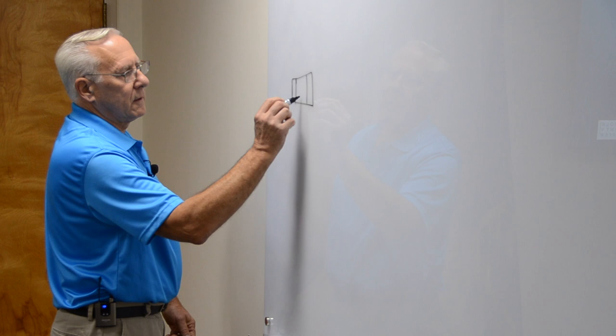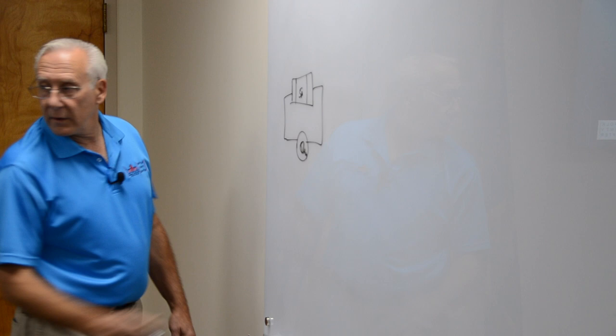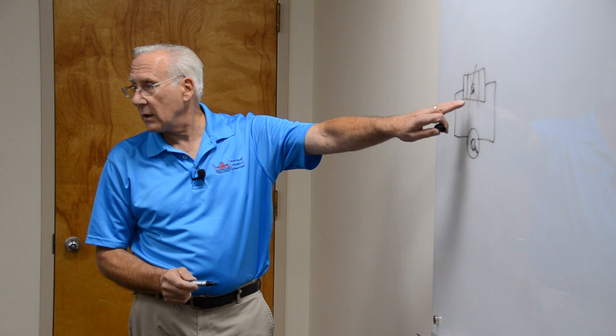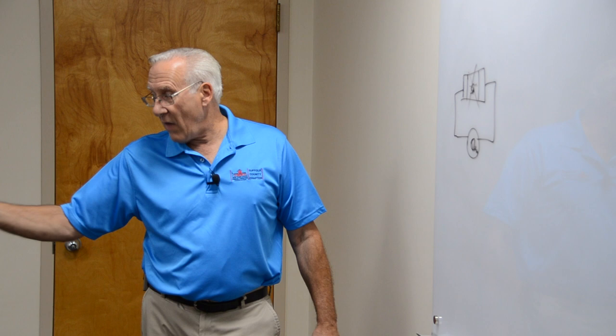You have a fuse, right? It's a 5-amp fuse, whatever. You put your meter here, put your meter here. You hear that, or you hear your own meter, ohm, which is what that is set on. If you get a reading, the fuse is good. If you don't get a reading, the fuse must be open. The fuse is blown. You can't see inside the fuse. It's in powder or whatever it is. There's a link in here, but to test fuses, you would use that. De-energized, out of the fuse holder. You cannot do what I just did energized.